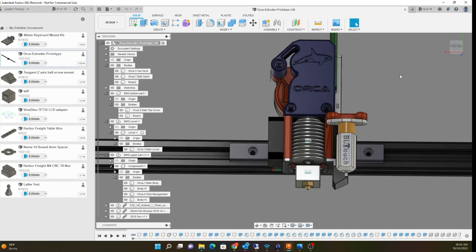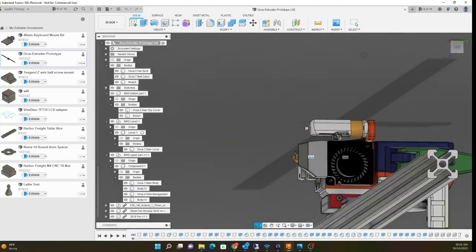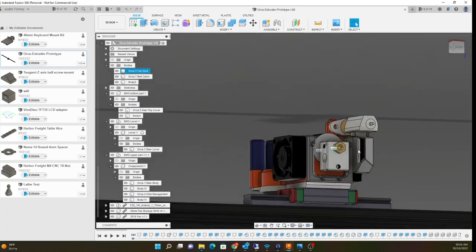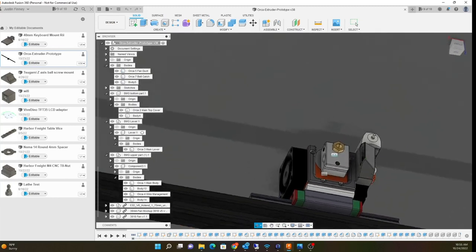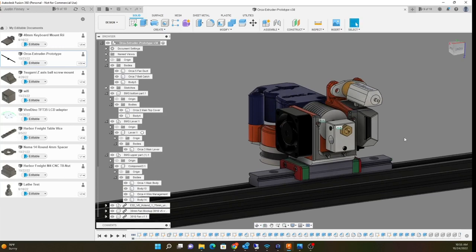The air system uses a 30mm blower fan on that side — that's the part cooling fan. Right now I have a single scoop, but I think a lot of people over-cool; their part cooling fan is too big and too elaborate. All you need to do is solidify the plastic and prevent stringiness. Sometimes when you over-cool you're cooling the part off — you actually want to keep the part warm. If you have a heated bed, you want the heat to creep up and keep the part stuck.